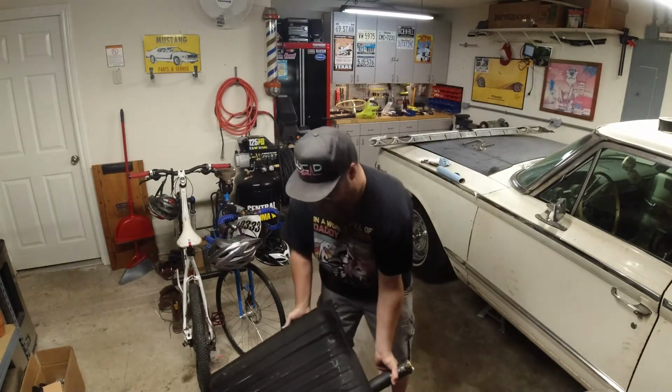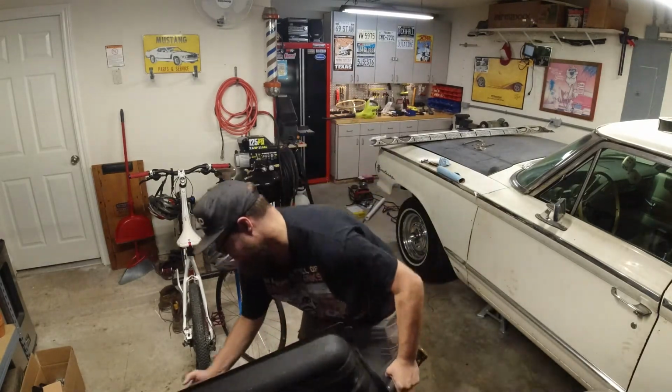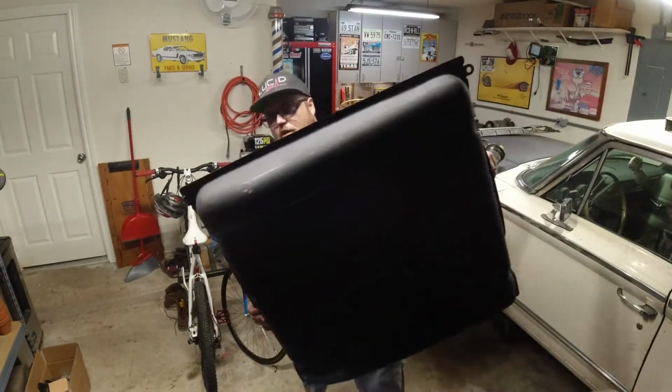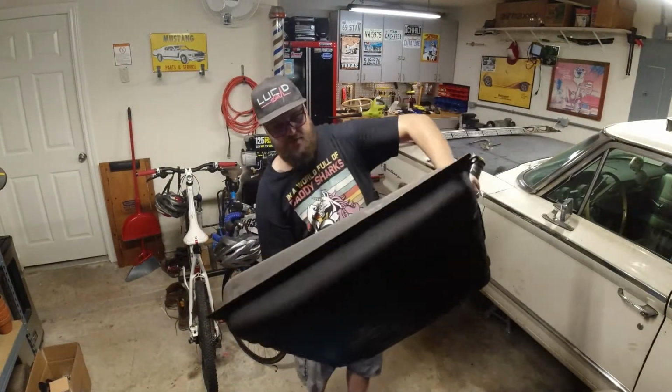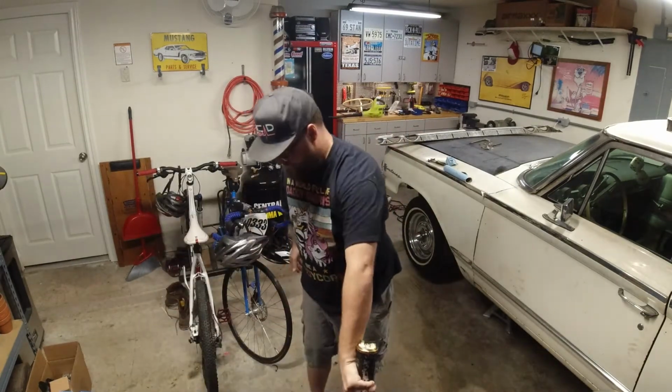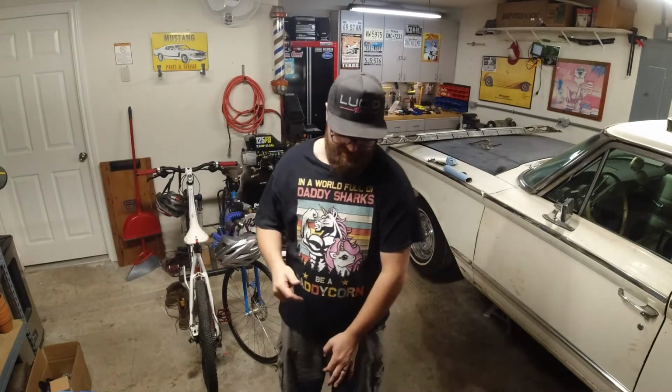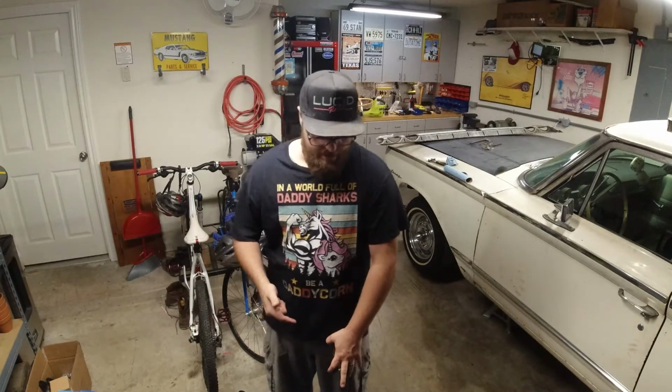I've plugged up the hose there with a bolt. I've got the plug in the bottom and the cap on. First thing I'm gonna do is fill it with some fresh gas and some chains, shake the hell out of it, and get everything that is loose broken loose in there before we go into the electrolysis, electroshock therapy.